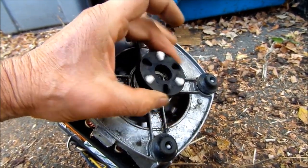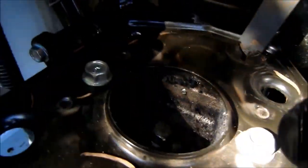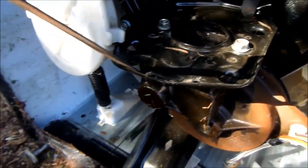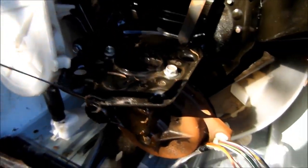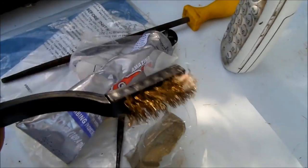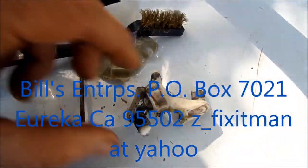So I'm going to use this old rubber grommet again and just turn it over so it's in a little bit different position. Then I'll clean that shaft up real good and put the new drive coupler on and glue it on — just like I did the other one. Clean it up and goop it on. So that's your tip of the day.